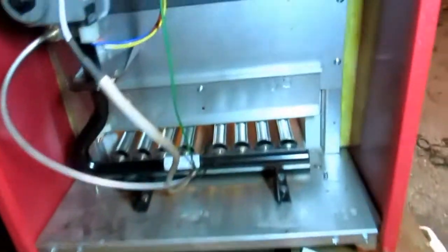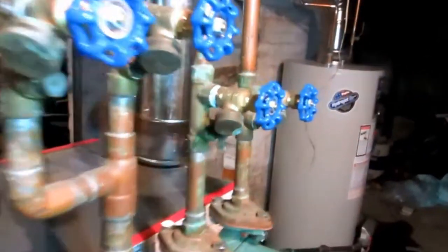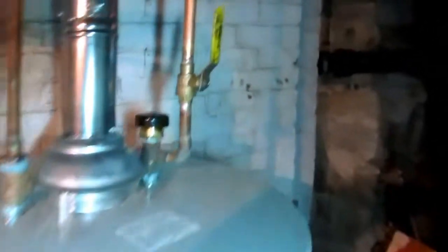Let me run through it here. There's a little three-zone control over here with a shut-off switch. There's a new feeder, no expansion tank yet. Three circulators with three zones coming in. Smoke pipe going up. I've got the water heater all hooked up with a little gas shut-off over there. It's up on blocks — a 40-gallon water heater going into the chimney — with a shut-off and vacuum breaker. And there's the gas pipe for the boiler.